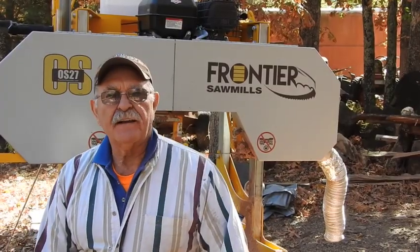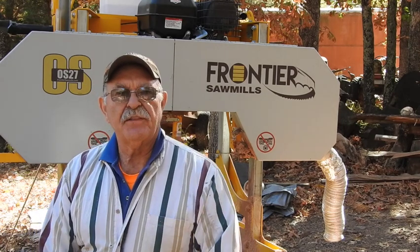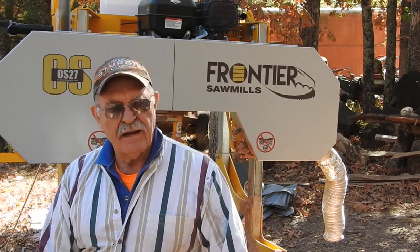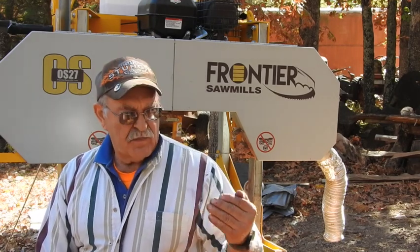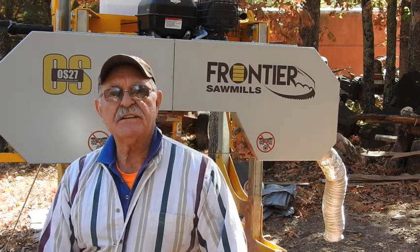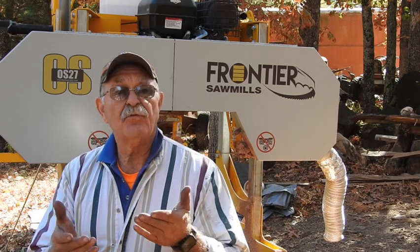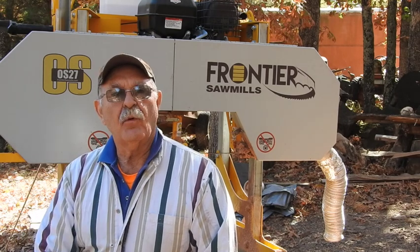Now that we're almost done for today, one of the things I thought I'd better mention is whenever you've got these bandsaw mills, you've got to make sure you stay on top of the sawdust. I didn't show any of that during the time we were messing with this one because with that thing 21 inches wide, it puts one heck of a lot of sawdust through there. You've got to stop and think about really green timber — it actually impacts itself in and around up in there, so you've got to get pretty aggressive about getting it out. I opened this up and there was so much impacted in there that it didn't let my safety switch shut the engine off when I raised the door. I thought that was a faulty safety switch, but nope — I just knocked that stuff out and it worked absolutely perfectly.